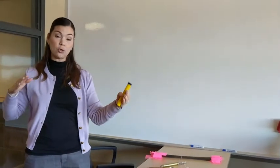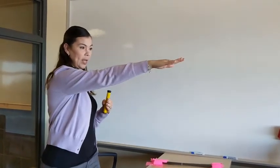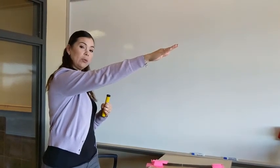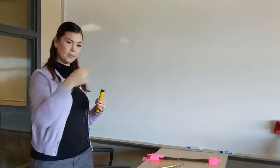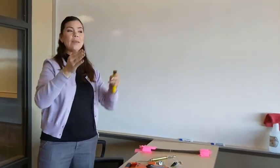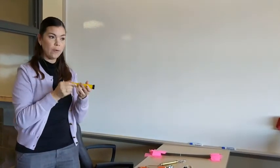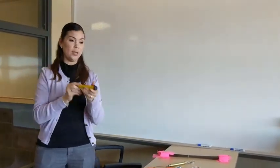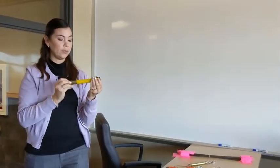Because if you think about it, it's a triangle, right? So this would be the straight line, and if someone's slightly higher, what you're actually measuring is the hypotenuse of a triangle, right? Does that make sense? Like this. And it's harder to do than you imagine. And even if you see that someone is higher, how high or how low you position yourself, this is why you need a third person to come in, look through the scope, and actually this stretches out like that, okay?